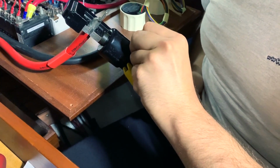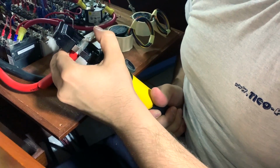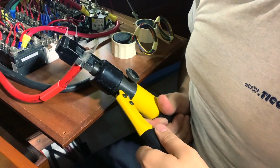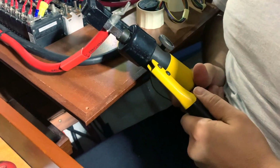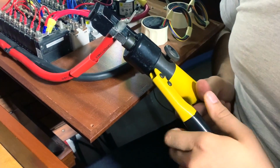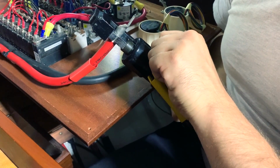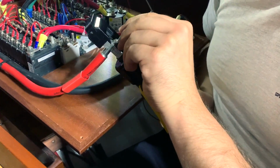Today is a very hard day with Gabriele, my friend, as we prepare the electric system inside Ellös. Gabriele has now crimped the positive that feeds the electric panel. I use 1/0 AWG cable, or 50 square millimeter, so in the future I have no problem if I need to feed more power on the cable. I use the biggest cable that I can.